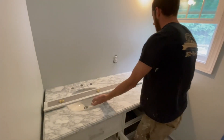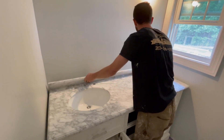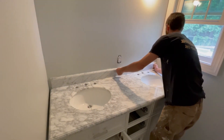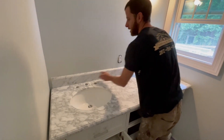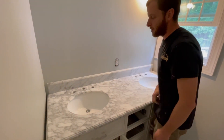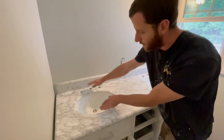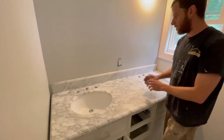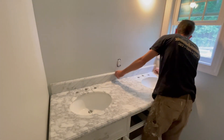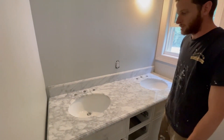You kind of have one shot — make sure you're somewhat centered when you put it in place. I don't really have to silicone the bottom edge since I already siliconed the back side. If you're nervous about it or having trouble getting it to stick, throw a piece of cardboard, pipe, or a 2x4 and wedge it in between to keep it nice and tight. Pretty happy with how that stuck. Make sure there's no silicone showing — it's hard to see sometimes. And that's installing the backsplash.